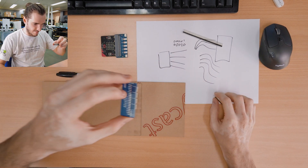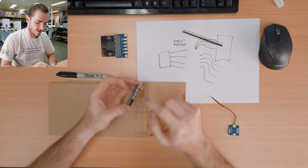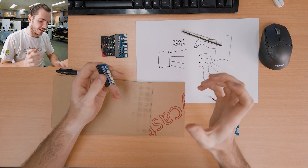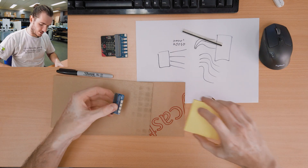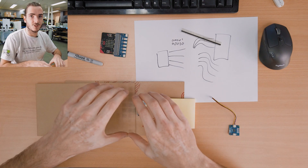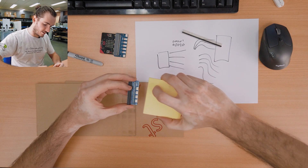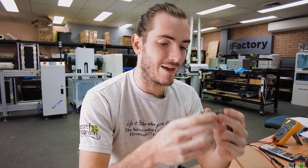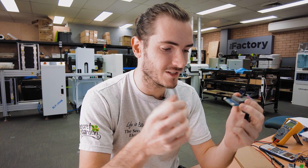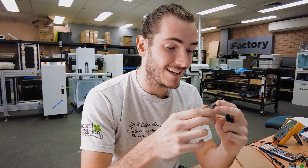Same with this board — if it gets mounted down onto a bed of nails, it still needs to be plugged into some kind of test circuit to test all the PicoDev connectors. Maybe the test circuit is just a self-standing circuit board that can just plug in. That mechanical alignment could be advantageous for doing really high volumes — you just drop it in, engage the jig, pass the test, pull the jig apart, and pull out your device under test, rather than manually lining up four connectors. In any case, those are just a few ideas about how we might make these test jigs so we can test devices in higher volumes. Perhaps next time I'll have a few prototypes to show you. See you in the next factory episode.